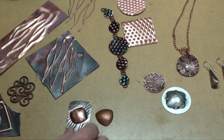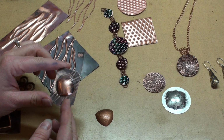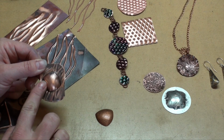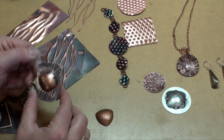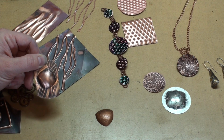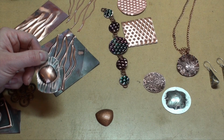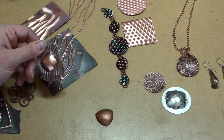Now, one of the things that people like to do once they have a nice little texture is to form that in a hydraulic press. Well, when you have an embossed shape that you try to form in a hydraulic press, it doesn't necessarily work so well. And you can see here, this was actually done based off of this pattern here. In this case, I have 24 gauge copper, and the whole texture has just completely flattened out. Even here where it was along the die that I was forming with has also smoothed out. However, there is still a little bit more here, but I did lose my texture here. And that is just because when you get that urethane forming into this, it just stretches your metal out and puffs it, and it releases that texture that you once had with your hydraulic press, again, because the relief is so high on this.